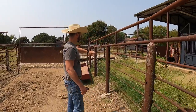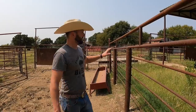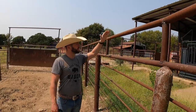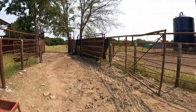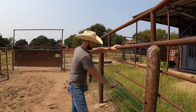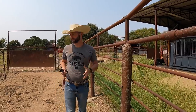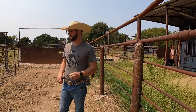We took off that privacy fence mesh. This is the original part of the corral — I raised it up and welded it to make it a little bit higher. We're going to come back with the rubber. We'll have to put two sheets of it because it's only about three feet wide — one conveyor belt here and one down below — so they'll bounce off of it instead of the metal. It keeps their vision straight and not left and right; we want them to run through it.